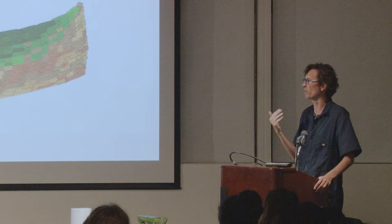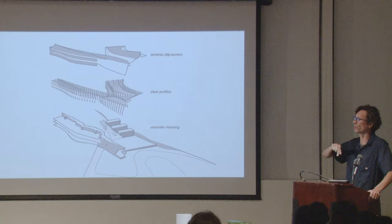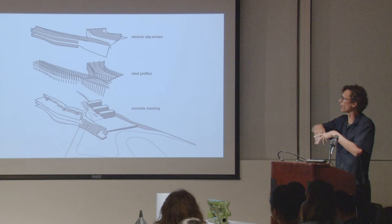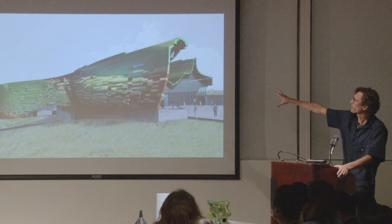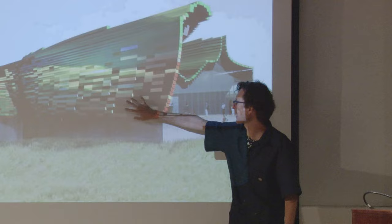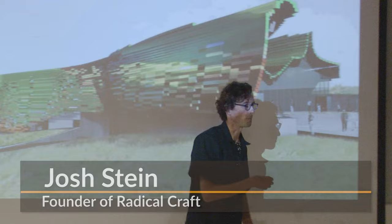And then there was a simple process that actually parallels, to a certain extent, the way those buildings that I was interested in downtown Los Angeles from the turn of the century work, which is that there's a structure made of concrete and steel, and then there's a skin, which is ceramic, placed on top of that. Or in this case, I almost imagined it as being draped on top of the structure. So basically this is their architecture proposal. Again, you can see here are the areas where you would have passive cooling. So this is an outdoor patio area that would be naturally cooled by evaporative cooling. Then in some of these areas over here are where we have the hot water passive heating systems.